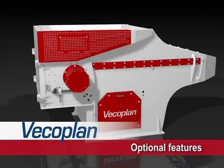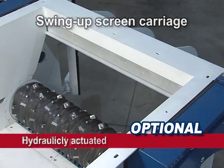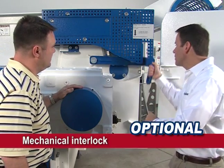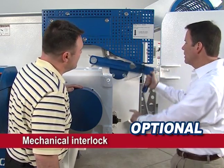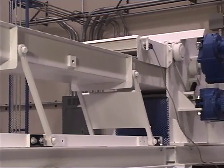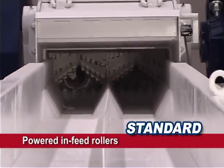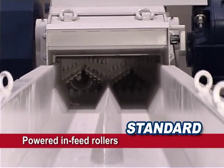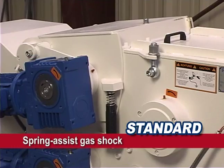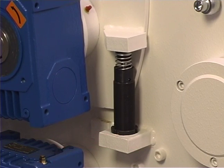Other optional new generation features include an externally adjustable bed knife assembly and a hydraulically actuated swing-up screen carriage with oversized port for easy clean-out, maintenance, and inspection. A mechanical interlock ensures operator safety while the screen is in the raised position. Horizontal machines have their own unique features too. Each comes standard with a minimum of two powered infeed rollers — a safety feature that helps prevent possible material kickback toward the operator. Machines larger than 14 inches wide are also equipped with a spring assist gas shock system that keeps the floating top roller assembly from slamming down during operation, significantly increasing frame and welding longevity.